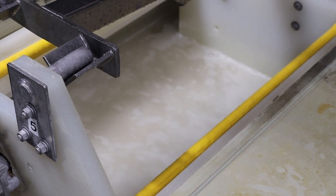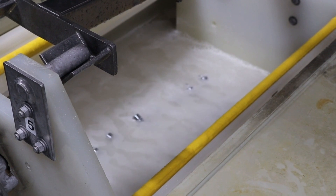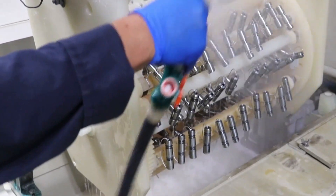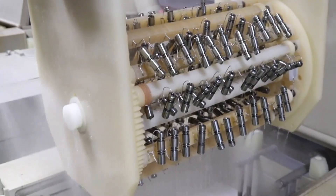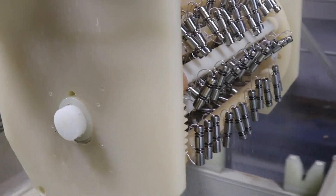Be prepared to remove the parts on time and with a hose to spray them off as they are lifted from the tank. After thorough spray rinsing to minimize drag out, move the parts quickly to immerse them in a water rinse tank. 20-30 seconds in the rinse tank should be sufficient.